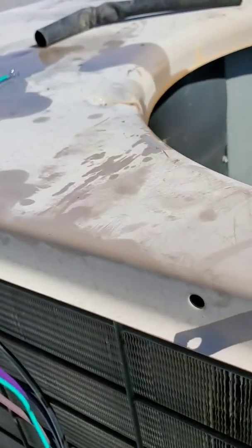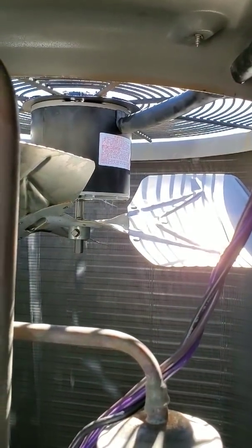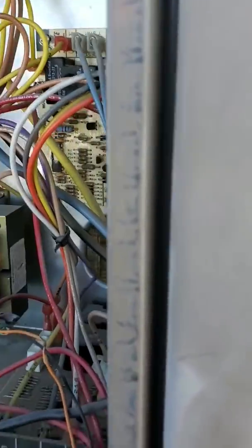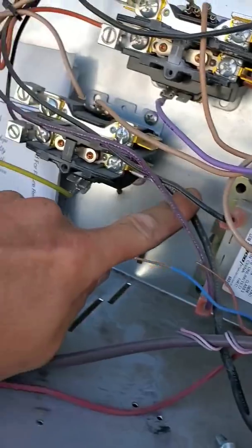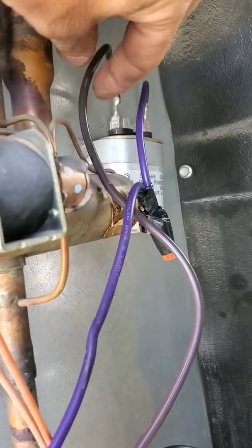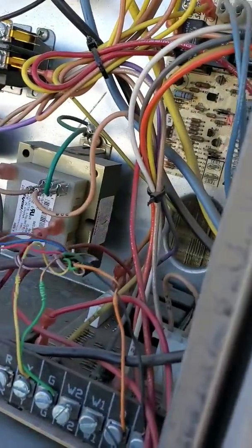The motor is intact with the blade on — make sure your blade is on nice and tight. I ran my wires through, taped it up so it's not moving. My black wire went to my contactor, the purple went to the common on my capacitor, and my brown went to the other side of the cap. So purple is your common, brown is for your fan on the cap — you need power in and power out — and the black wire is your speed wire, your high speed.